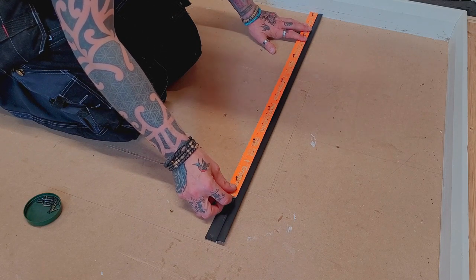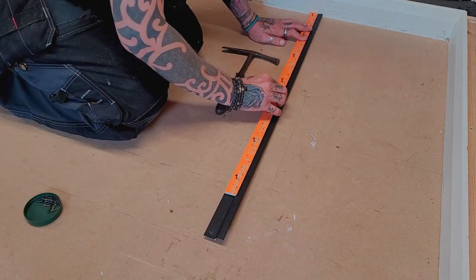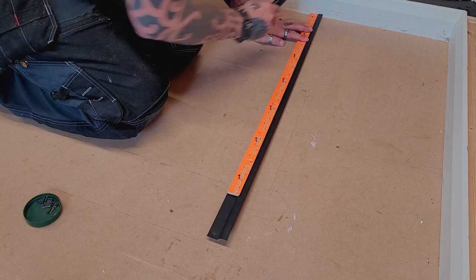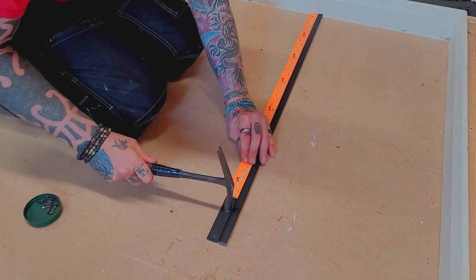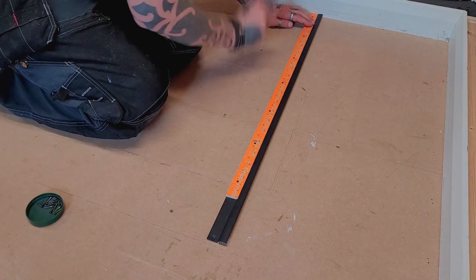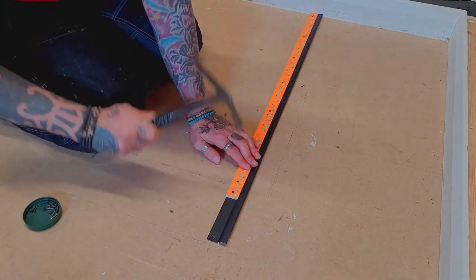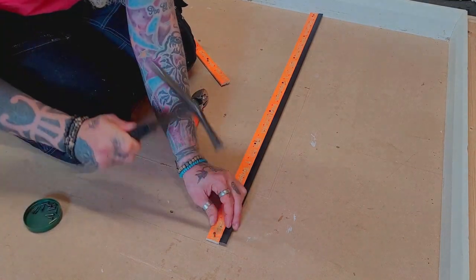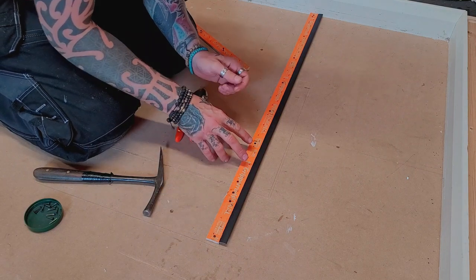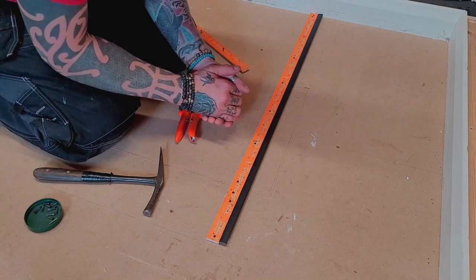Place the gripper on top and then pin straight through. Get that chamfer up against that chamfered edge on the Zee Bar. Making sure I've got fixings within 25mm of the end. The more secure the gripper, the stronger the hold on the Zee Bar, allowing it to dress down.